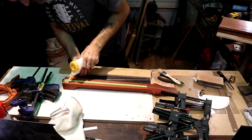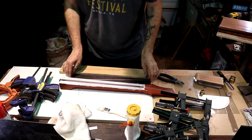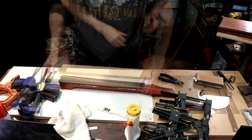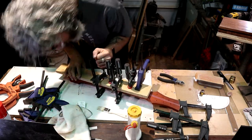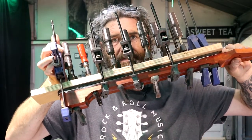Let's do it. We'll slide the fretboard straight down on these toothpicks. I'm alternating sides so it will sit flat without rocking. I'm going down the fretboard like I always do from one end to the other. We've got our fretboard glued to the neck — I've got good squeeze-out all the way down. I've got some cleanup to do, but that's the shape I decided to go with at the end of the fretboard.